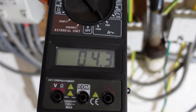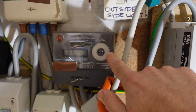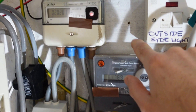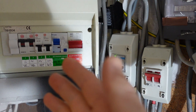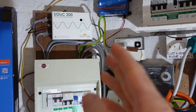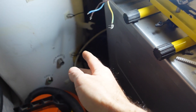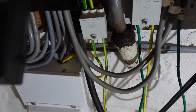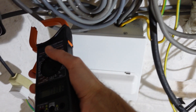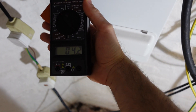There's other things going on and off in the house probably, changing it. But that's about 4 amps coming into the house — you can see this meter has changed to flashing, which means we're importing. This Solic is basically matching the solar with the grid, which it shouldn't do. It should only bring in power from the solar and chop the power to reduce what's going to a resistive load — the immersion heater — accordingly. So it should never be importing. But it's importing 4.4 amps.